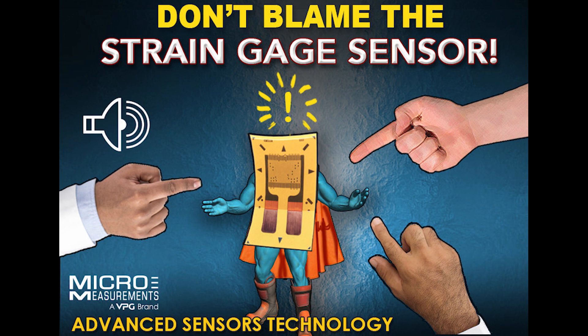In my experience also, Daryl, that flux over time is mildly corrosive. It can actually etch through the gauge foil, creating worst case an open circuit — or really worst case, bad data as opposed to no data. It can cause ultimately failure of the gauge installation that can't be reversed by cleaning. That's a fantastic point. Not only does it lead to drift due to the conductive path to ground, but it's also an etchant etching away part of the metal. Constantan gauges are about half copper, and you can actually see little green dots under high magnification — just like copper that weathers outside — because the flux etches away at that copper and it turns green.